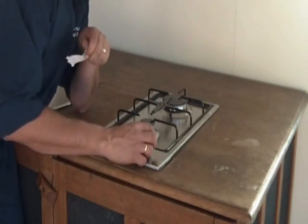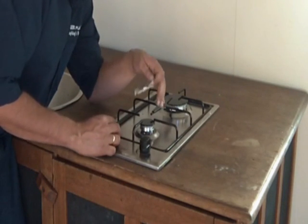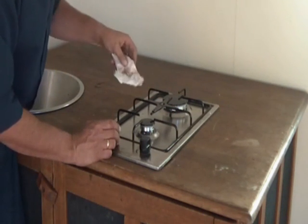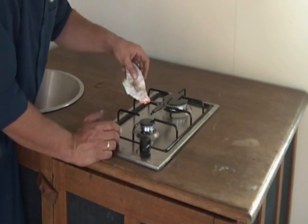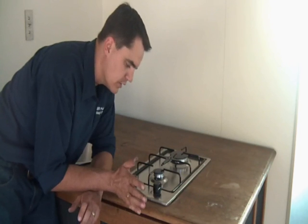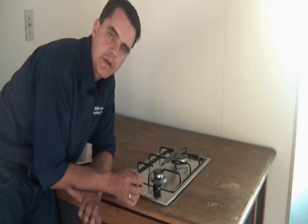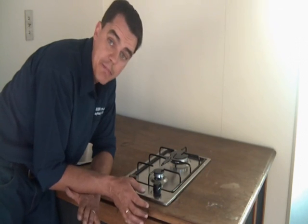It's nice and hot. Now let's do the first one — there's our flame ignited, nice and hot. Perfect, the biogas working as designed. As you can see, the conversion is simple to do on an LPG oven. Just to close off: please make sure you always do it as per gas legislation, because it is a flammable gas and there is a risk involved. And all that remains is happy cooking!